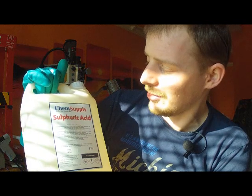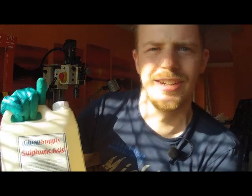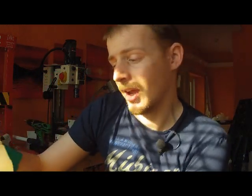This is 5 litres of class 8 pure sulfuric acid — about 99.8%. It's very strong. You will only need 200 ml of that stuff in 2 litres of water, so it's a 1 to 10 ratio when mixing. What you might find easier to get is car battery acid — that's sulfuric acid again — and with that you only have to dilute it 50%, half battery acid and half distilled water. With pure acid, only 200 ml to 2 litres of water. That's all you need.